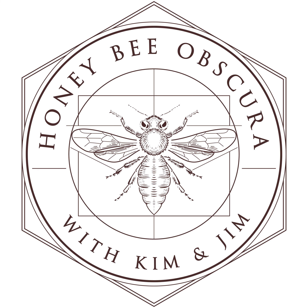On the floor drain: you need a big drain. You need something that you can get cleaning equipment down there to get that wax out, because that wax is durable and waterproof. Just because you run it down the drain doesn't mean it goes away — it just goes down a few feet and hardens. If you've got a two-inch drain you're trying to use, it should have been a six-inch drain so you can get proper tools and augers down there to clean it out about once a year.